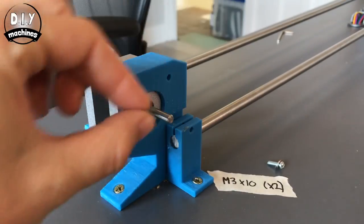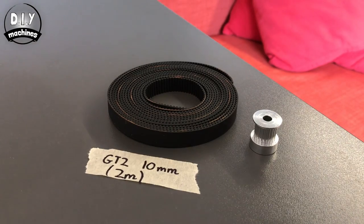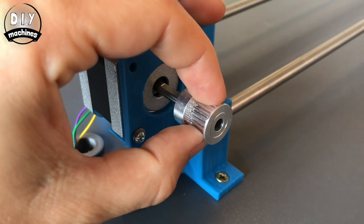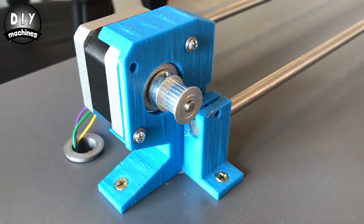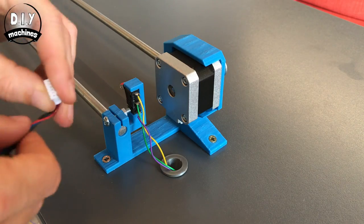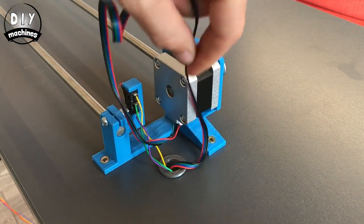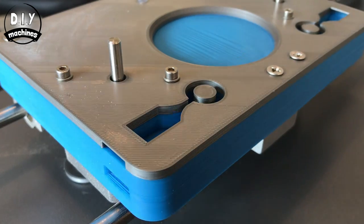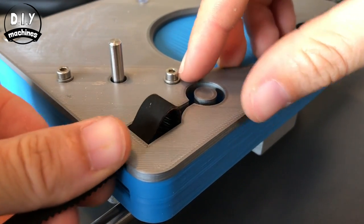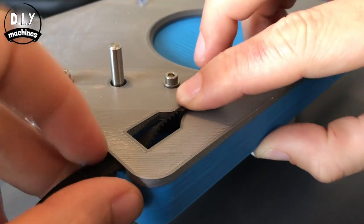Let's build the mechanism to pull the raft side to side. When fitting the pulley onto the shaft of the stepper motor, ensure one of the grub screws is attached to the flat side of the shaft. Insert the end of the timing belt into the raft, push it all the way through, wrap it round the pin at the end and interlock the teeth in the narrowest part of the passageway. This will hold the timing belt in place.